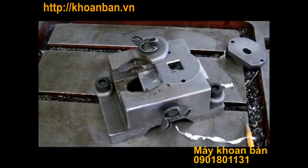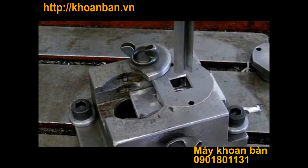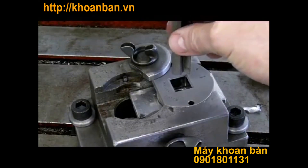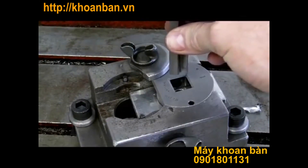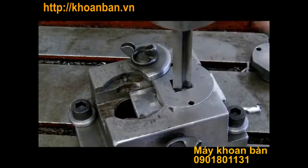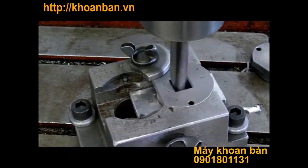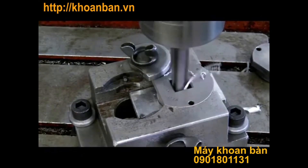And we'll switch out drill bits. Zooming in a little bit, you can see we have the special drill ready to go and again, it will float or articulate on the end of the holder. So we'll just put it down into the guide and we'll turn the drill press on, and what it's going to do is this three-sided drill bit is going to find the corner of this square hole. And we'll just pull it down through the material.